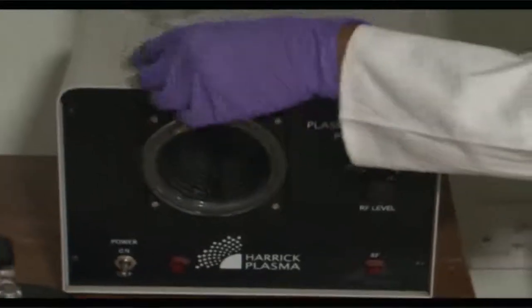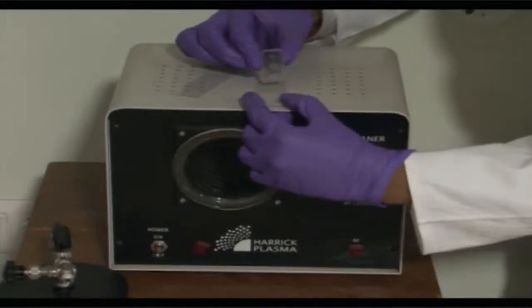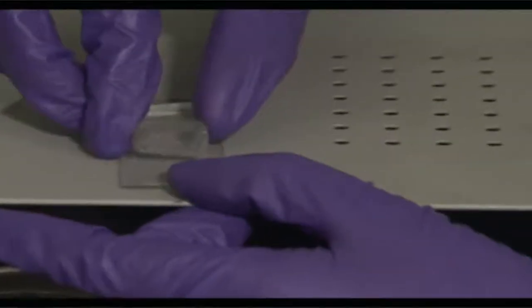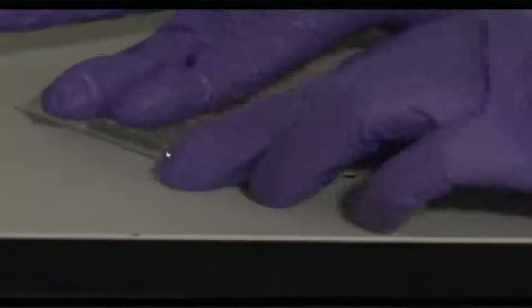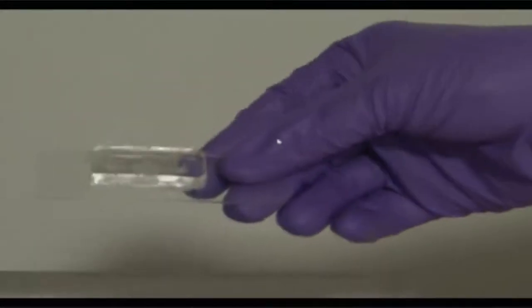So, as this plasma process is complete, we can switch off the plasma, okay, and take out the samples. And then quickly overlay the pattern side of the PDMS to the exposed wafer surface. Okay. This is very important because you should know what is the pattern size of the PDMS, because you are trying to close that size for doing microfluidic delivery. So you have a microfluidic device now, where you can do flow control on the surface of this PDMS. You can put the inlet outlet ports on both sides of these drilled holes that we had done earlier, and so therefore you can have a very good flow channel which may be only defined by the feature size that was there on the laser wafer or laser made PMMA substrate, which was only a few microns.